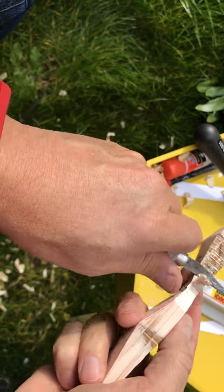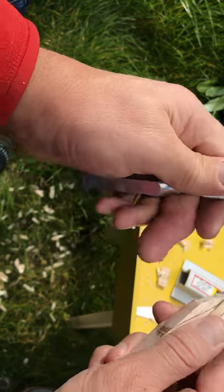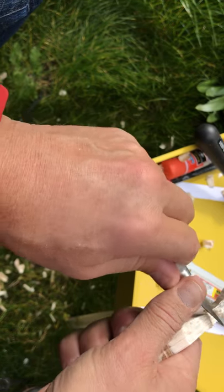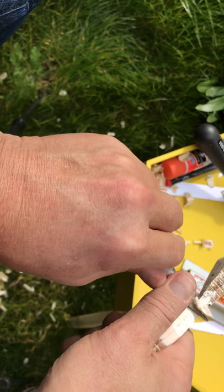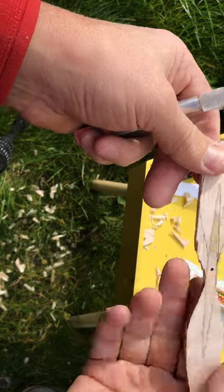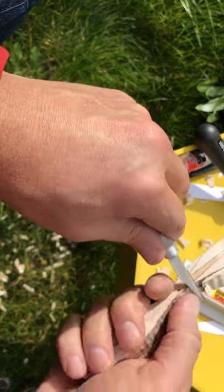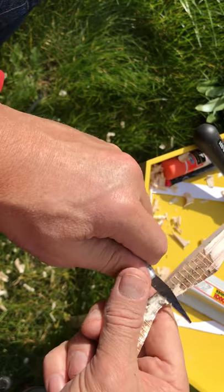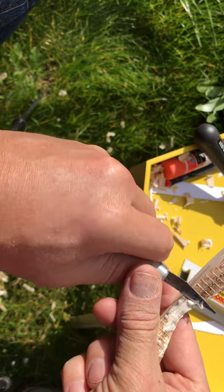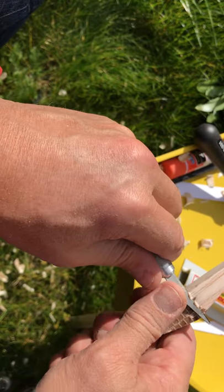You're basically going all the way down to the plywood core. When you hit plywood you're done — I usually try to stop right as I get there. Plywood is showing up there. Maybe the perforation just pops right off, and it guides you. The wood is a little bit darker where the laser has burned it, so you know when you're getting down to the surface that you're interested in exposing.